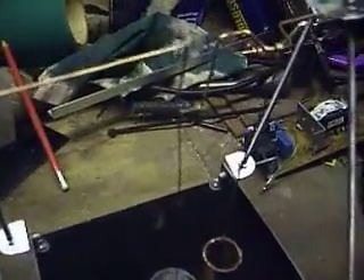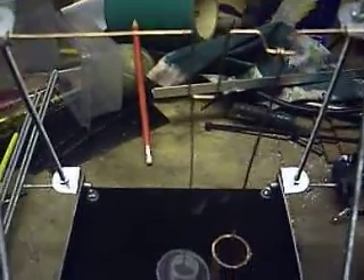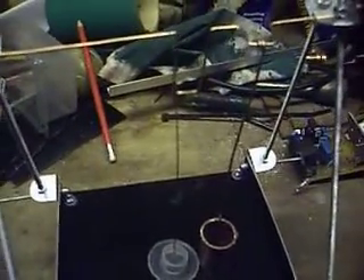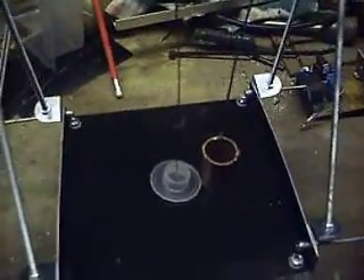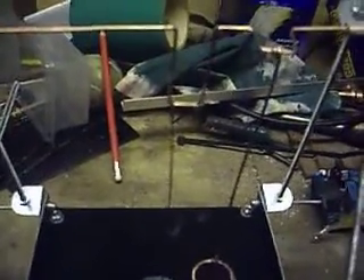The rod that runs down — that small one — I thought a 1mm thick rod would be enough and didn't think I'd bend it. But while I was running it, I managed to bend it. Unfortunately the bend is inside there above the CD — not helpful. So the rod for the displacer is going to get replaced with a 2mm rod.